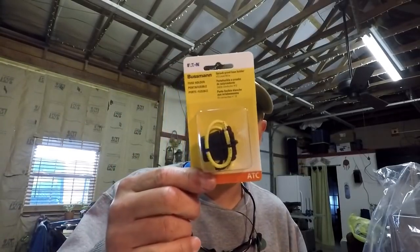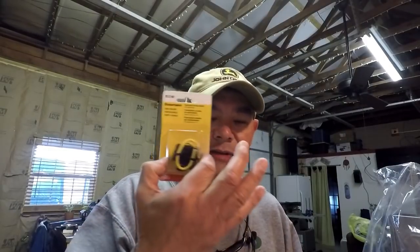One thing you did not see out there in that feed shed is this right here — an inline fuse. Everything will have an inline fuse from the charge controller to the battery. I will have a 10 amp fuse because it is a 10 amp charge controller, so it will be fused. I will probably also fuse the battery to the actual load, which is the lights. The lights are drawing about 0.66 — we'll round it to 0.7 amps — so I will probably put a one amp inline fuse in there.